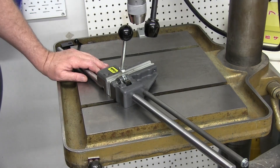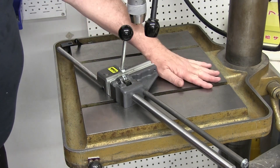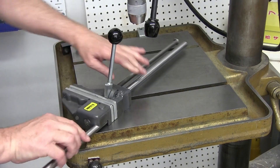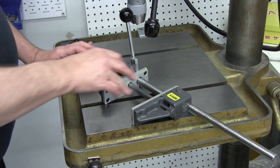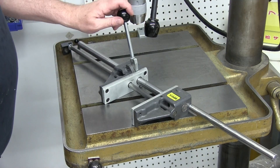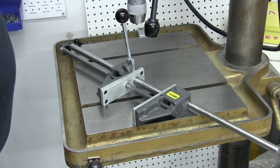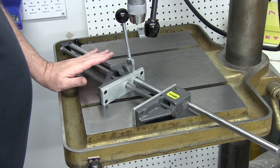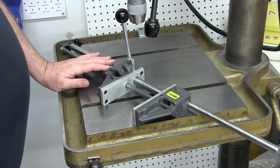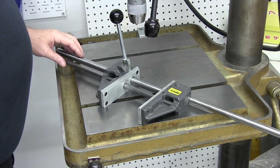It's sort of like a foot lock vise that can attach to the table, and then the jaws open up and close. They've got a step in them so you can do flat plates and sheets. The big difference is that it uses a cam lock type mechanism instead of a crank, which for me was the deciding factor because I just didn't want to have to do the little flippy-over thing with the crank. So I ordered this, took about a month to get here, and it's got pluses and minuses. There are some things I really love, some things I don't. Let me go over how it works and show you what I like and don't like, and what I did to correct that.